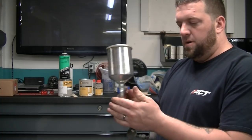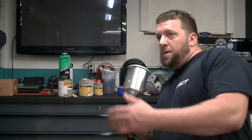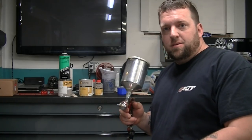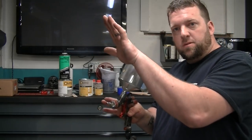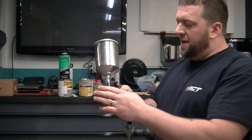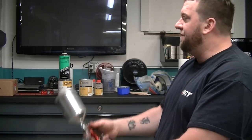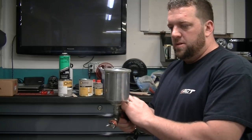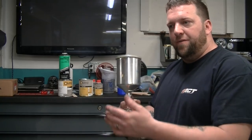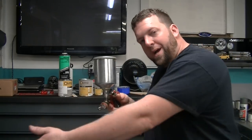You rotate the gun around for however you want to spray, because right now it's flat. You rotate it this way and it's vertical. If you're painting down like I'm going to be doing and also painting up, you're not going to want it flat because it's not going to work right. These are your adjustment knobs for your fan - if you want it tighter or wider. I forgot lacquer thinner - son of a bitch, I knew I forgot something at the store. When I get some paint in this I can already feel the fan is probably too wide. I'll have a piece of cardboard and I can just hit it real quick to see how it's working.